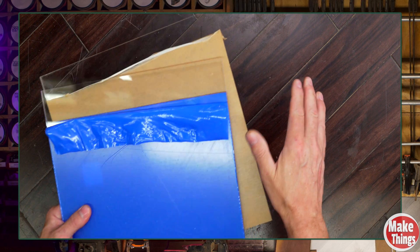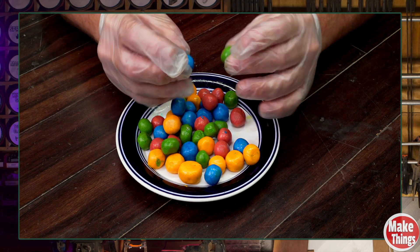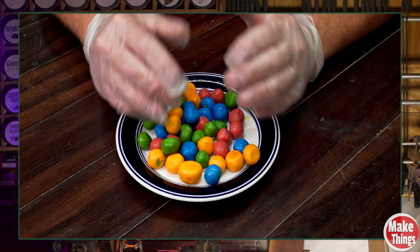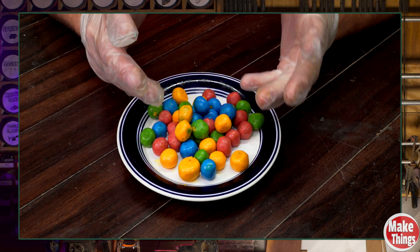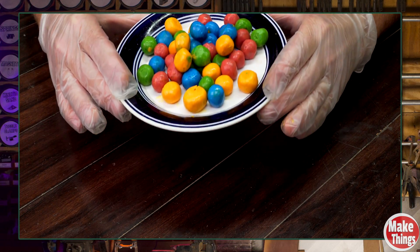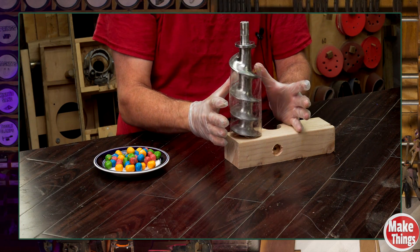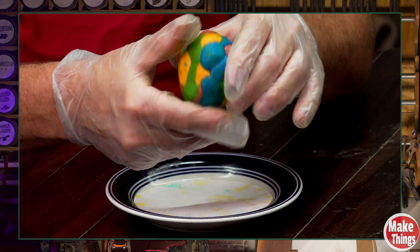Let's quickly go through the extrusion process so you get a better understanding of what's happening. Plastic starts out as pellets, or sometimes shredded scrap material — just little chunks of plastic, each one separated and unorganized. These can be virgin plastics, recycled plastics, or a mix of both. They're dumped into a machine called an extruder and heated until they're melted down. Then a spinning screw pushes the mixture along, compressing it tighter and tighter and building up all sorts of pressure inside the material. When it's done it's basically a giant melted batch of plastic.